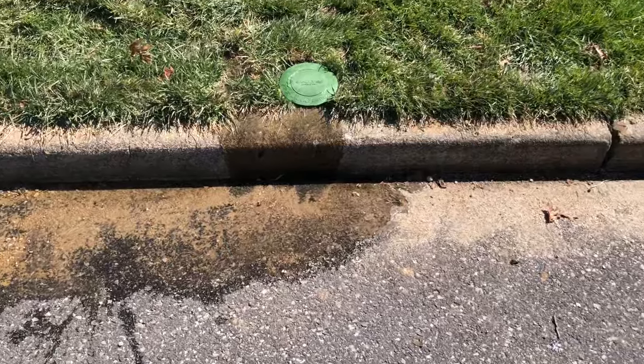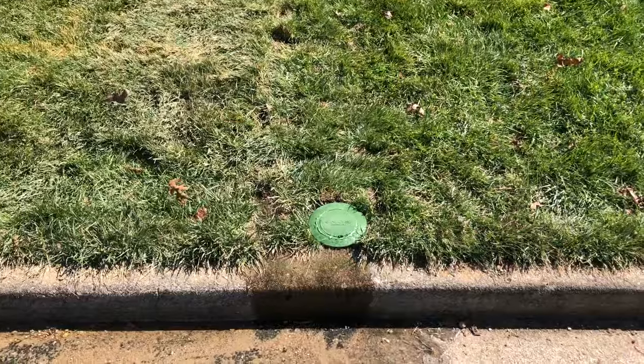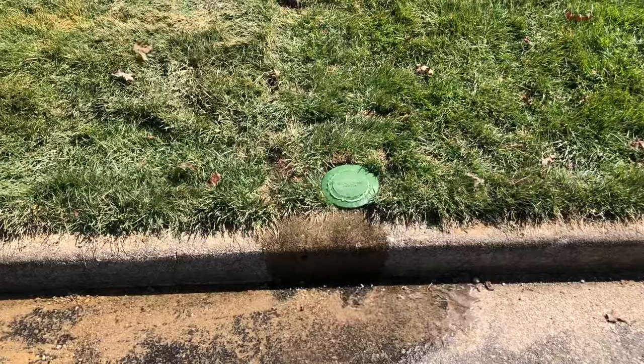The water facilitates over the curb and goes down to the nearest storm drain at the end of the street. That is exactly how you prevent your crawl space and your yard from flooding — by simply running your downspouts away from your foundation, which also helps prevent costly foundation cracks. Another job done with Georgia Shore Drainage Solutions — as always, like, share, comment, subscribe, and until the next one.